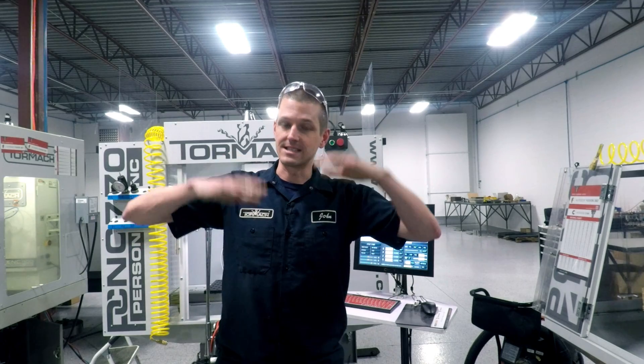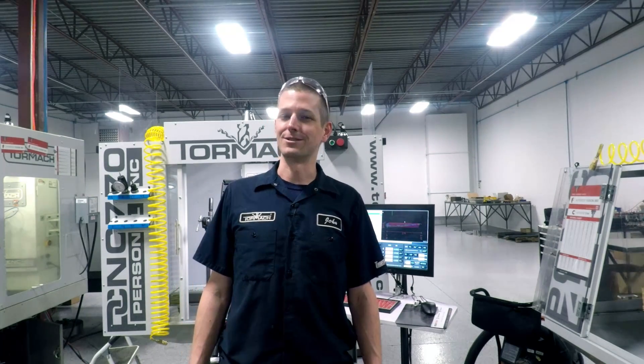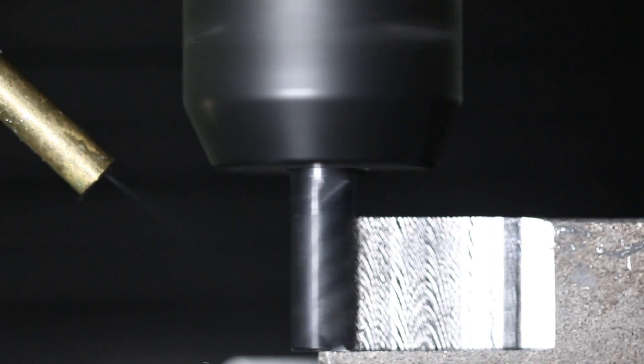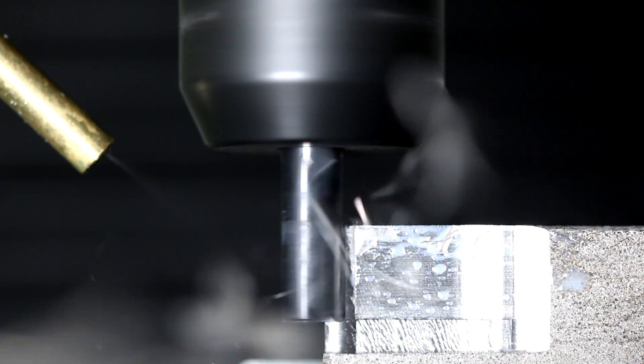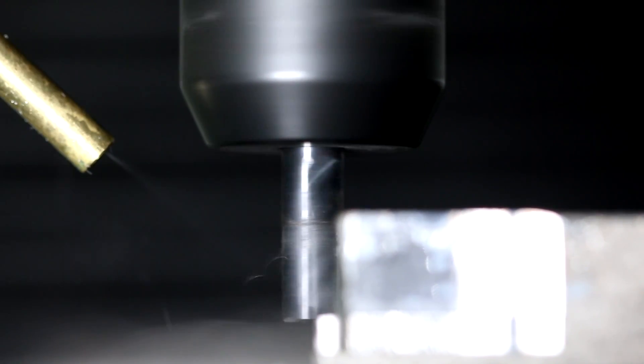For me, I'd much rather have safe cutting operations: it's not going to load up the flutes, it's going to leave good surface finishes, and you're going to get good tool life out of it. If you want to maximize material removal, you do need to take the time to build up that zigzag method — bump up the surface footage a little, bump up the chip load a little, alternate back and forth, read your chips. Speeds and feeds are this giant mystery and they don't have to be, especially with basic materials. When you get into stainless, Inconel, or titanium, you need to stick to certain recipes or else you're hosed — but steels, aluminums, coppers, all that stuff is fun to machine. Take care folks, see you soon.